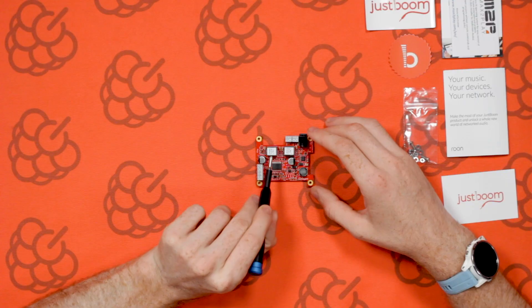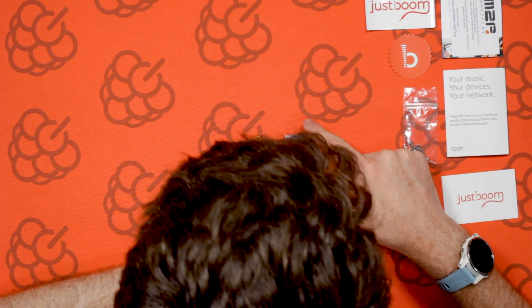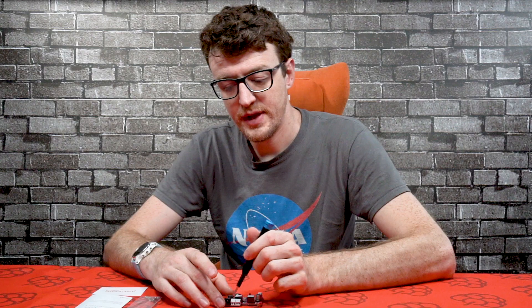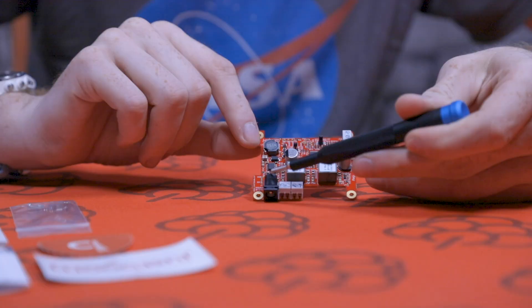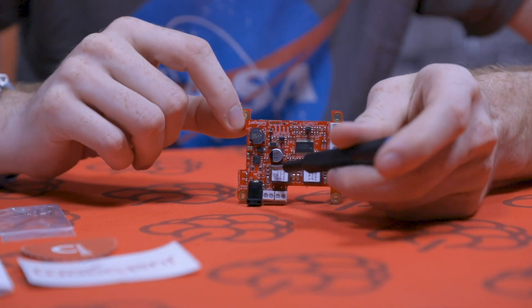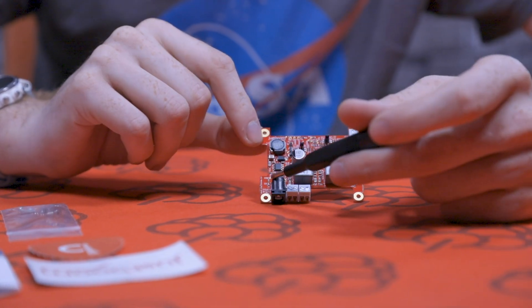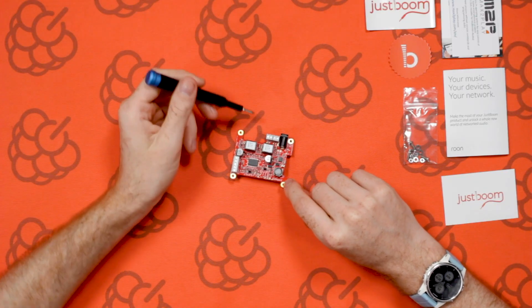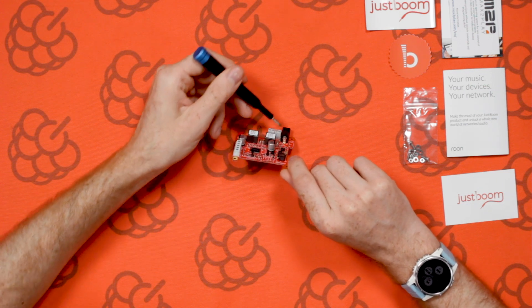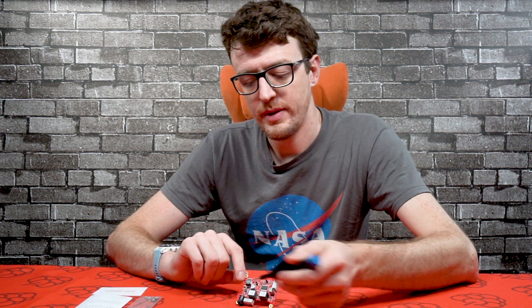The other big components you can see on here are two coils for the amplifier, then a little inductor, and most of the other stuff is supporting circuitry. This area is the power supply circuitry and the output stage. The power inputs are here — this is the DC power input jack, and just above it there is a little two-pin header called P2 with a plus and minus. If you want to use power not from a DC jack, you can solder a two-pin header into that spot. Normally it's easier to use the 2.5mm DC jack, which can take an 8 to 24 volt input.